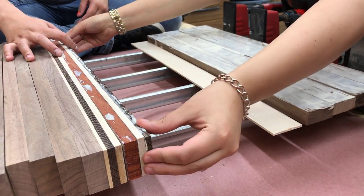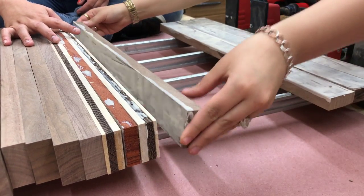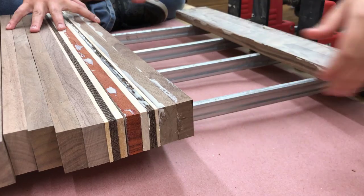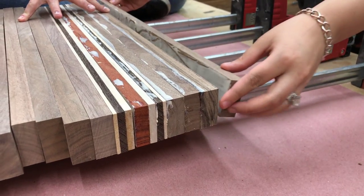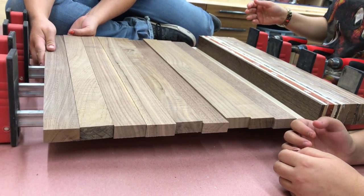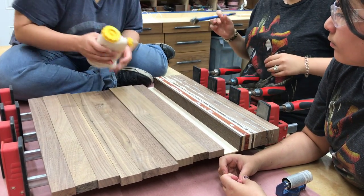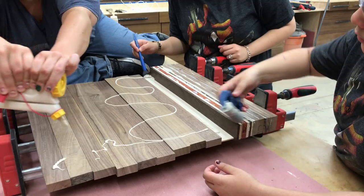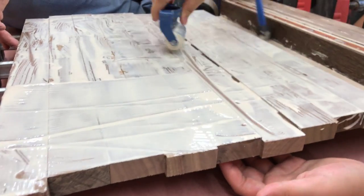It's best to keep them sort of straight, though it's not super critical since we cut everything an inch or so longer than the final length. A glue-up this size really has to be done in two steps — spread out half, glue them, put them back together, then slide that half back, spread out the other half, glue it, and then put the whole thing together and clamp it. And there you have it — lots and lots of glue. That's the only way to put one of these together.